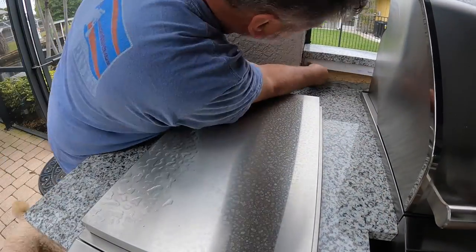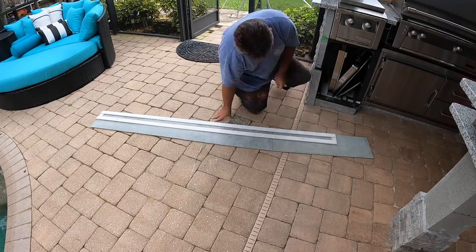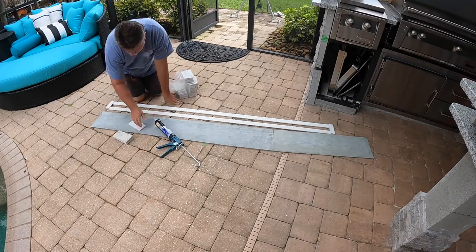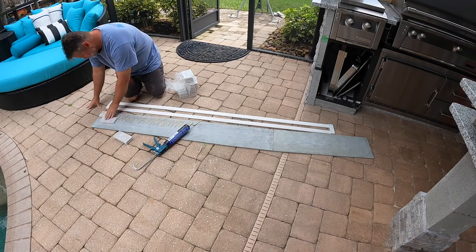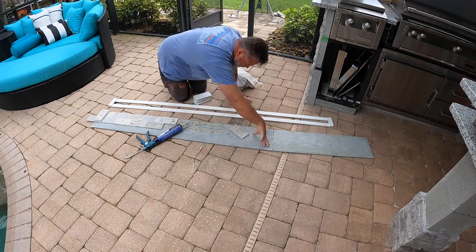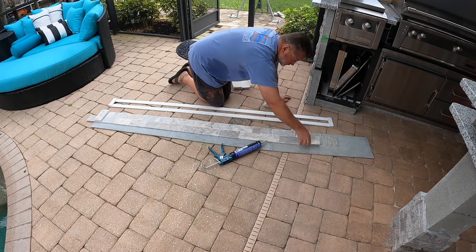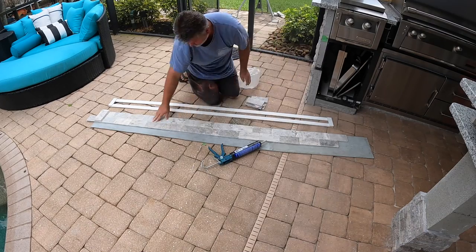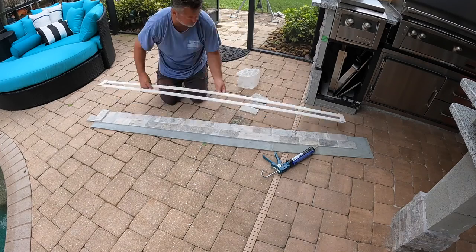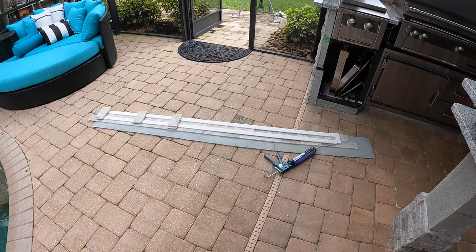First, here is how I did that area right behind the grill. I ended up making a template — I kind of copied the idea from the granite guy — laid it out on a piece of concrete board to make sure I had a long enough section. I decided to use liquid nails because I didn't want it to be too brittle; if it wasn't slightly flexible when I put it into position I could loosen up the tiles and they could potentially fall off. So I laid out two rows of stone with liquid nails, let it set up overnight, and made sure I exceeded the size of that template.